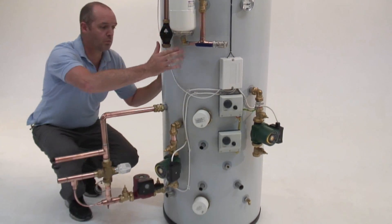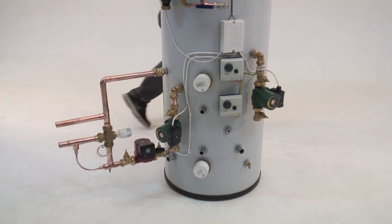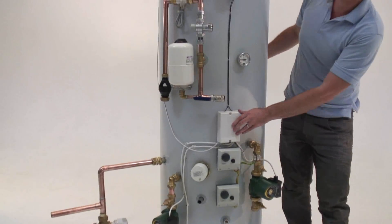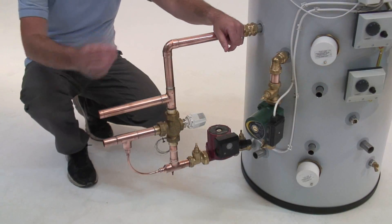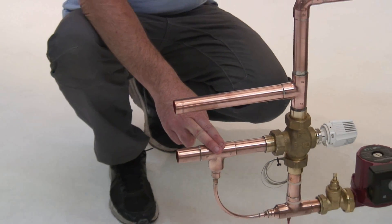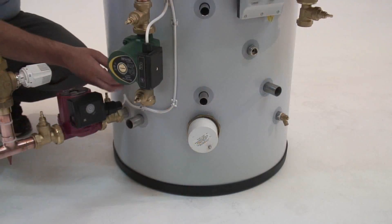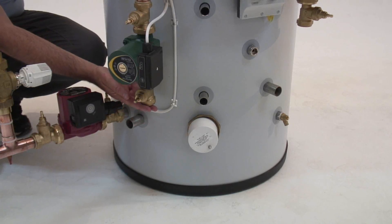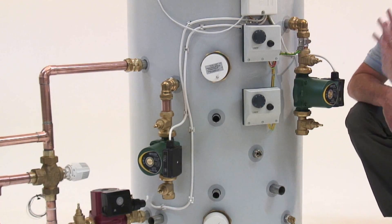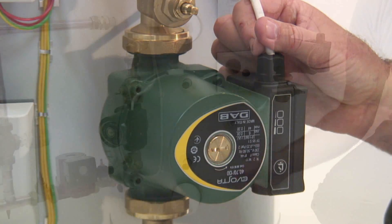The trick is to combine them so that when the wood burner is lit, your boiler doesn't need to come on, or only occasionally. This pre-wired, pre-plumbed thermal store takes all the pain away from installation — it's plug and play. You just plumb the flow from the wood burner here and the return here. Likewise, your gas or oil boiler flow here and return here. Here is the central heating pump, flow and return — the pump is already fitted and wired up for you.